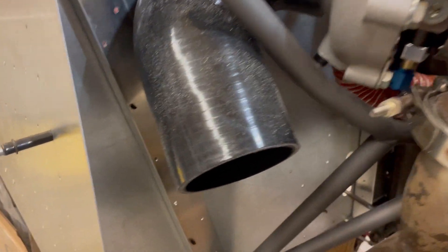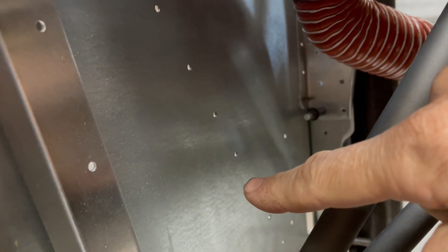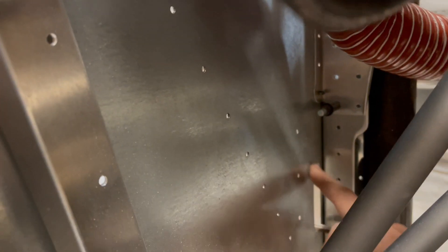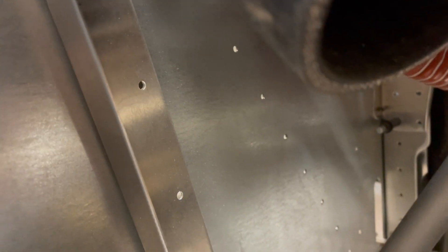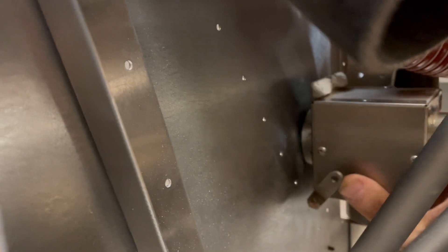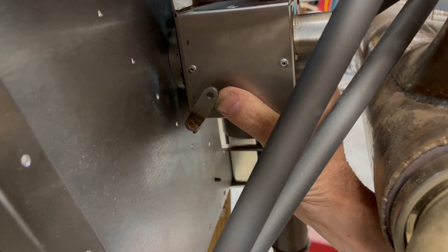The only other place I can see is right back in here. There's a brace where the rivet line is, so I can't put it directly through that. There's not enough room here because it hits the engine mount. You've got your steering rods coming from the brake pedals out to the nose strut. So I've got one little V right there that I think could potentially hold this little heater box — but I've got maybe an inch of wiggle room, and it's already getting close to the heater muff and the exhaust collector.